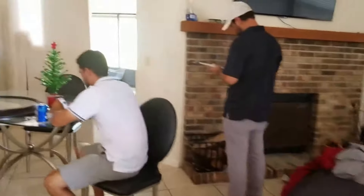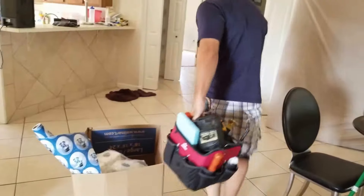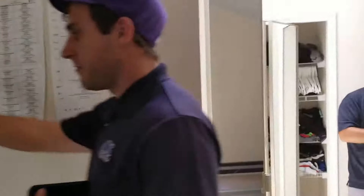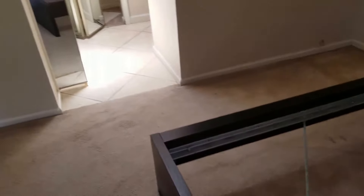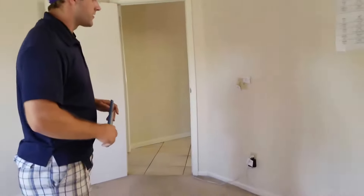It's kind of better just because it's continuous in the kitchen. The carpet in this room and this one over here will go too, tack strip will go. I'm assuming because it's wet all the way to the walls, the tack strips are probably pretty broken down as well. So baseboards — basically anything wet is going to go. The walls get drilled with some holes and then we're going to put a bunch of equipment in here and it's going to sound like an airport for a couple days.